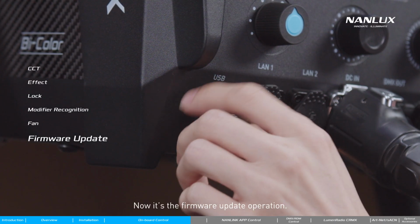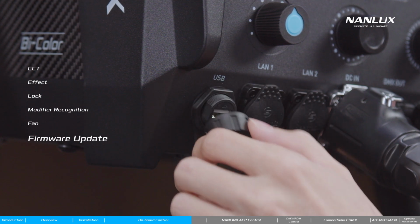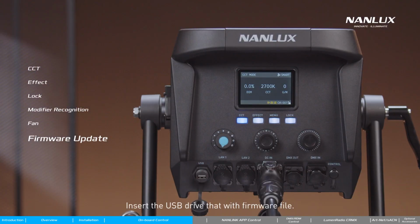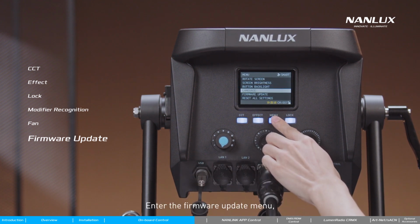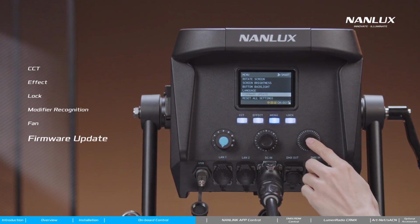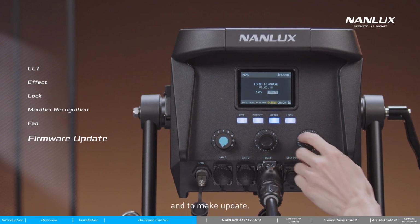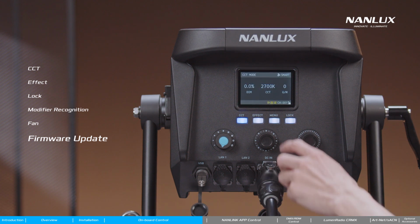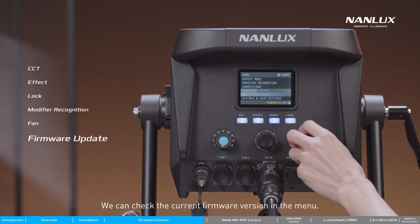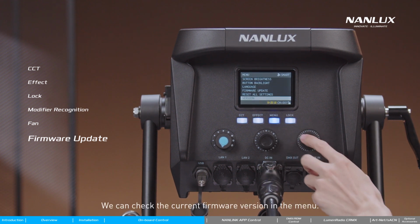Now, it's the firmware update operation. Insert the USB drive with the firmware file. Enter the firmware update menu. And make the update. After the update, the fixture will automatically reboot and display the operation interface. We can check the current firmware version in the menu.